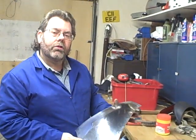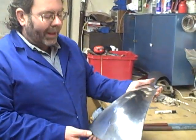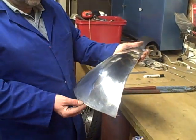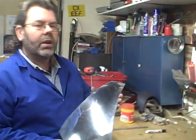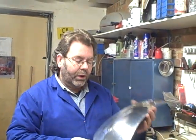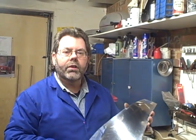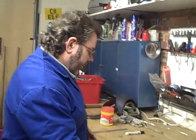Now I'm going to talk you through it and explain exactly what we're doing. I've roughed up a piece of metal here, malleted it out, run it through the wheeling machine to replicate a similar sort of shape. I'm going to cut this in half, prepare it, and gas weld it together. I'm going to wash it off and clean it and explain about the importance of removing all the flux. We're going to planish it smooth and then re-wheel it and hopefully end up with more or less an invisible weld.